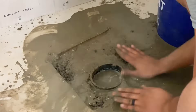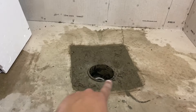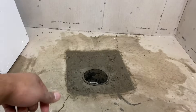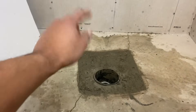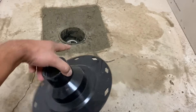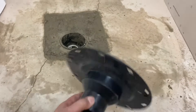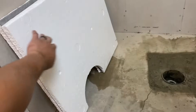Just like a fence post, you don't need to mix this beforehand — just pour it in and add water and stir it up with a mixing stick. It'll solidify and become totally structurally sound. We backfilled the concrete box-out with pea gravel and quick-set concrete. It ended up taking two and a half bags, so it was a lot deeper than I originally thought — but it's about 16 bucks. We'll give that a day to cure and then turn our attention to waterproofing: the waterproof membrane, the edge banding, and the shower pan.